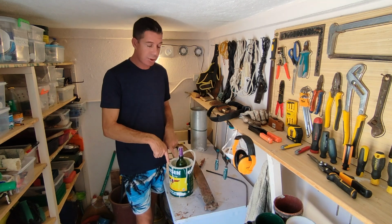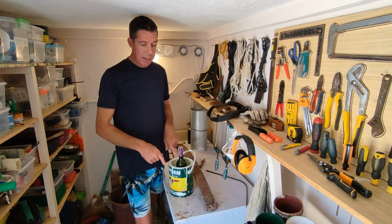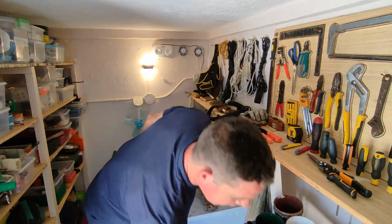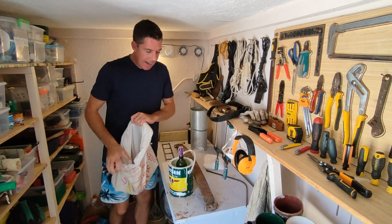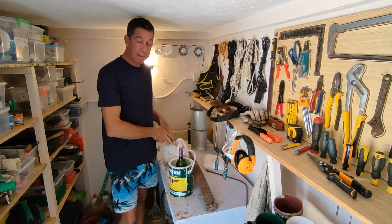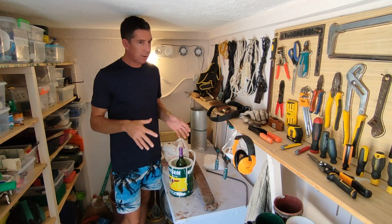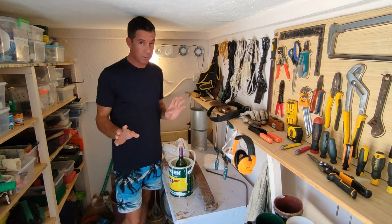The first thing is to make the forge. What I'm going to do to make this little mini forge is mix up plaster of Paris with some sand that I got at the beach out the front there, and it's a really nice fine sand that I've filtered. I'm going to mix it one part plaster of Paris, one part sand, and one part water, and I'll pour it in here and let it set probably 4 days, so it's definitely not got any moisture in it, because any moisture when I start to heat this thing up could cause things to not work out well.